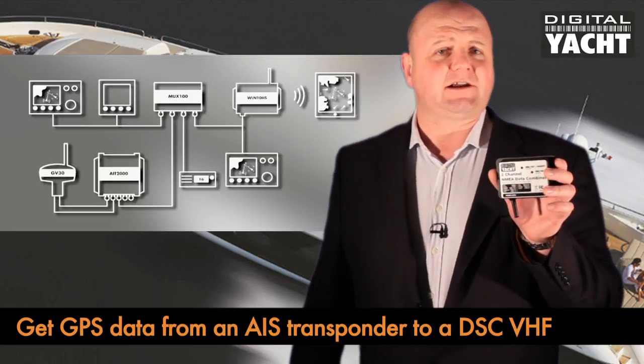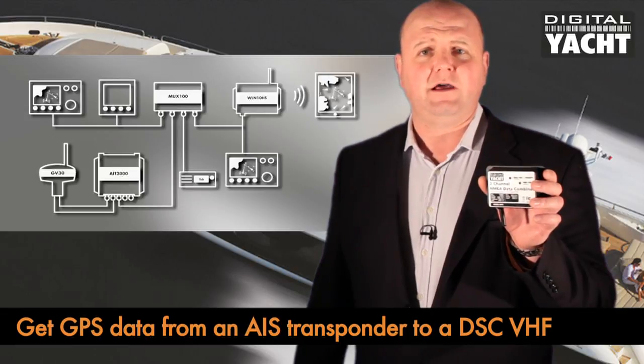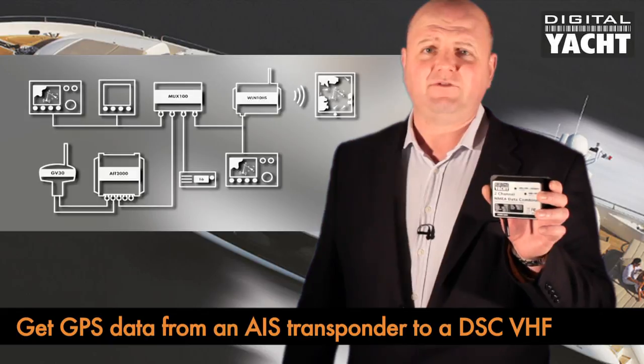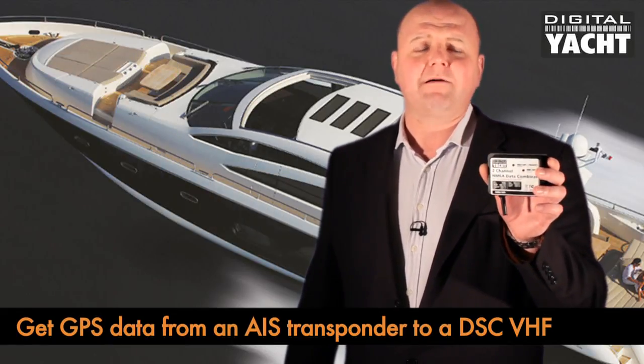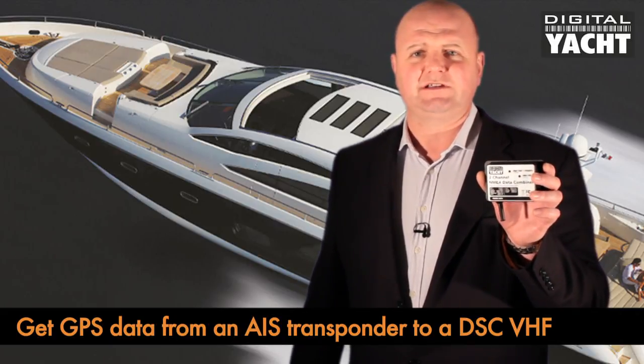It can actually extract GPS data from the high speed 38,400 baud output and retransmit it at 4,800 baud, which is the standard that's needed for DSC VHF radios. So the MUX100 really is an all-encompassing, easy-to-fit solution for NMEA interfacing difficulties and so on.